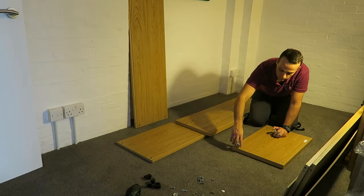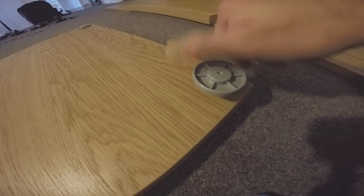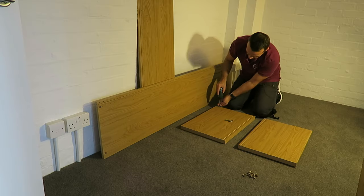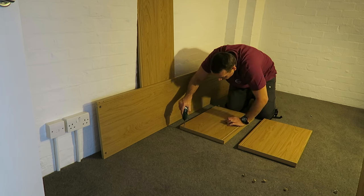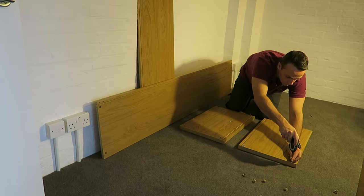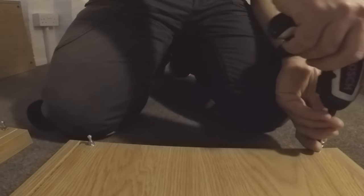Let's do it now. Starting with the bottom panel, we're going to have four adjustable legs. It's a good thing if you have an uneven floor or you want to lift the unit a little bit higher. Just screw them in, and we can do the top panel and bottom panel from the other side — four screws, just secure them in. Go till the stopper, not any deeper, otherwise you'll have a problem connecting with the side panels.